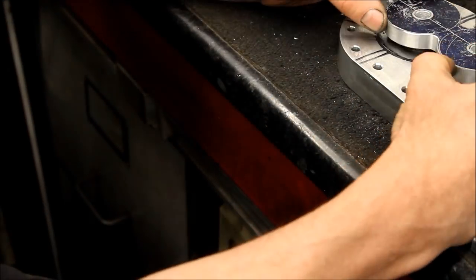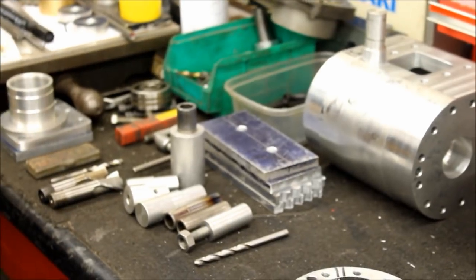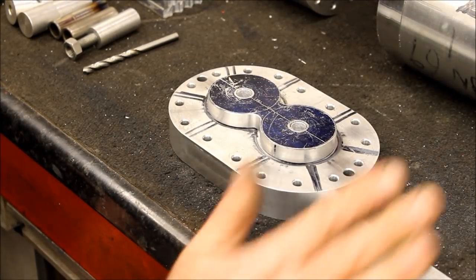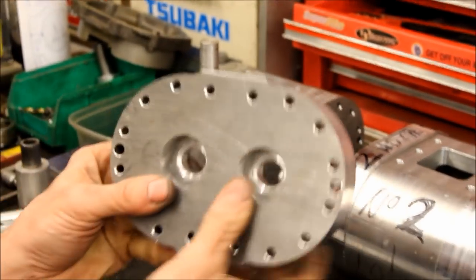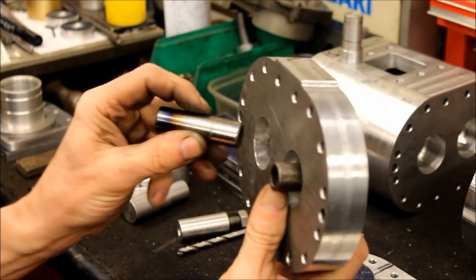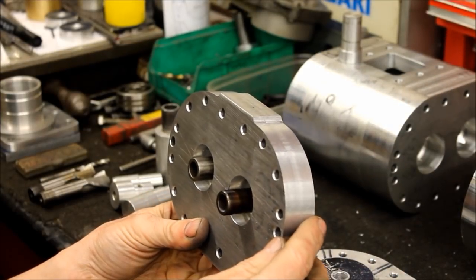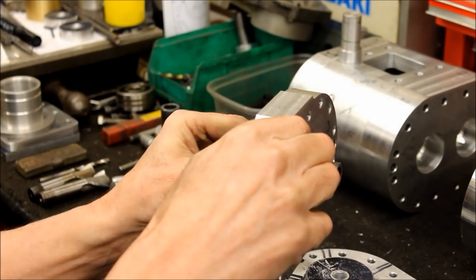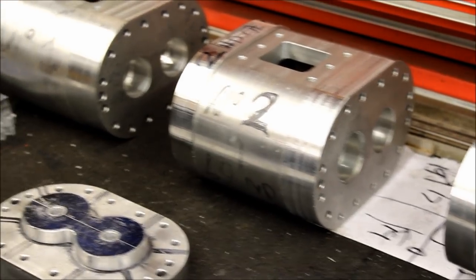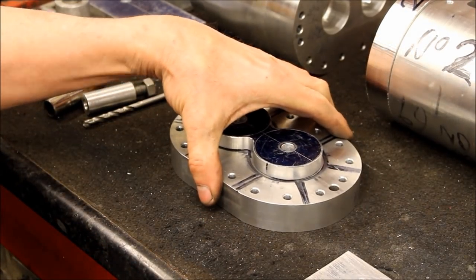Once I've done that I can then redo and make another three of them. I've made a couple already - always handy because sometimes you make an odd mistake when first setting up. We've just got to mill these side faces down. We've got to put two mandrels through the holes - done to 18 mil - with a couple of good dowel pins in there. Once set up in the vice you can just rest it in and polish them two sides down, keep turning it round so they both end up within a few thou. So we'll come back in a week or so and see how you've done. Once I've got three done they can go into storage and I just want to concentrate on the one for the Honda. And with that we'll call it a day - thanks for watching.